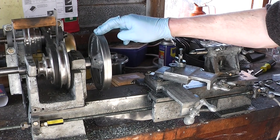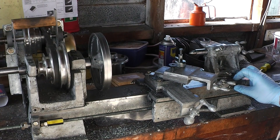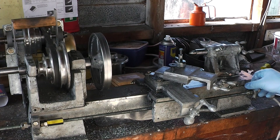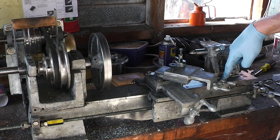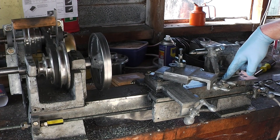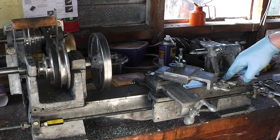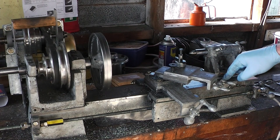As for the tailstock, the base of it is pretty straightforward — nothing too amazing in terms of the casting, the clamps, or the shims. The real wrinkle is in this locking bolt, which doesn't actually get measured out in the book, because every one of these lathes is different. You're going to have to carefully measure it yourself so that the bolt doesn't collide with the ways, and then drill it according to where you measured.